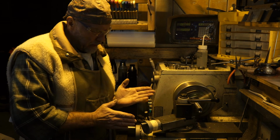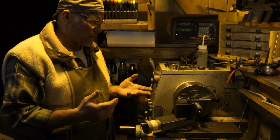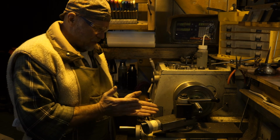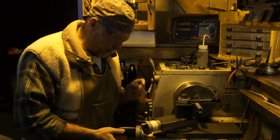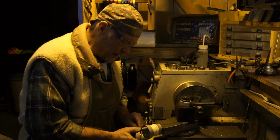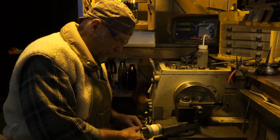So now I'm working in the area between 0 and the number 0.18. It's because this dial has 200 thousandths of rotation. Right here I got it done. I'm down to where I'm working with the last few numbers, the last 20 numbers. So I just erase the old one, I start with a new one. I back off from my 18, I go back to my chicken out groove, I go back into 18, 18 is the new 0, and now I'm going to go in and take another pass.